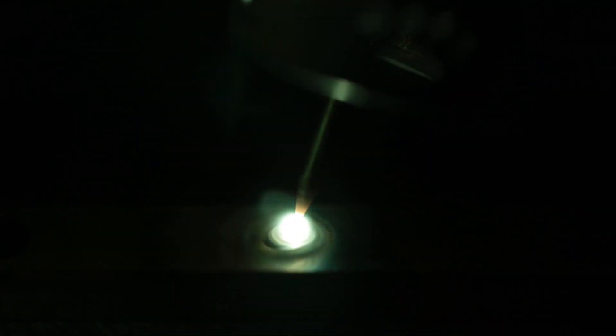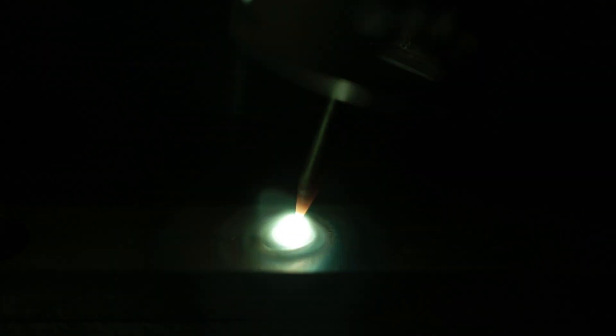33% on time, 33% background, and 33 pulses per second is a little tip I picked up from Jody over at Welding Tips and Tricks — obviously you're probably following the guy, he's awesome. 33%, 33%, and 33 pulses per second is a pretty good go-to for a lot of different applications. Everybody has their specific preference. Some people won't weld over 50 pulses per second, some people weld at 120 or 130 pulses per second — it's kind of just preference.